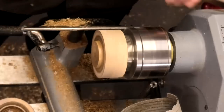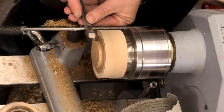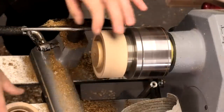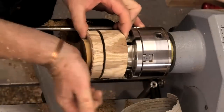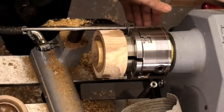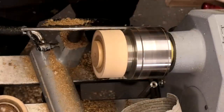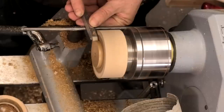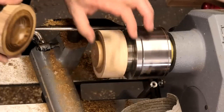Be careful — got a little lump in the corner, we're clean in a minute. I've just picked up the skew — clean out the little bit in the corner, just want a little bit off there. Nice and gentle technique, those two tools. Get our lid so it fits on. We know we're going to get a gap because of that curve shape we put in.